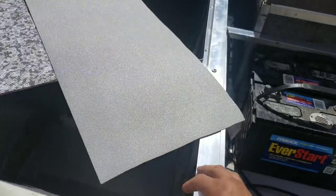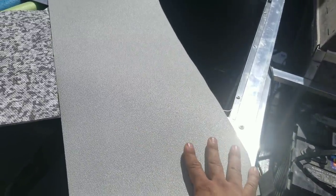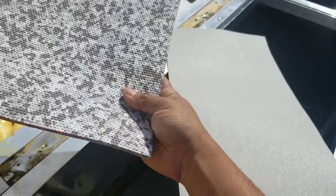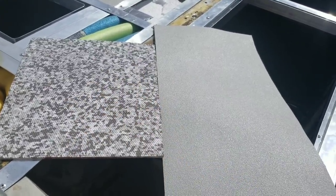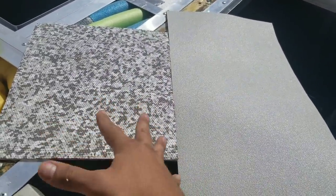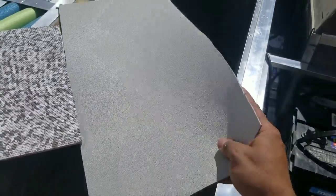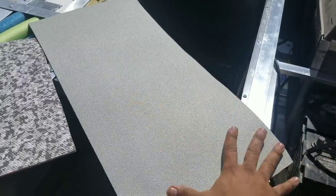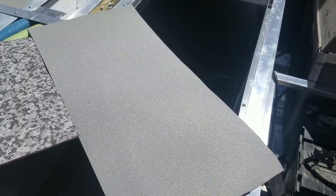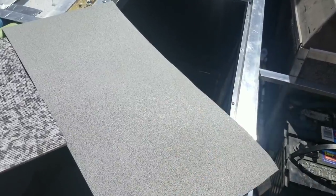This, on the other hand, is high-performance stuff. This stuff will not fade. The non-skid texture will not start to wear out in a month — who knows when it will start to wear out. I use it on most of my boats and there's really no cosmetic change to this. This is neoprene rubber. C-Deck is foam, guys. Honestly, how long do you think it's actually going to take before foam starts to degrade in the sun? If you put C-Deck on your boat sitting outside, don't expect even really a season of marginal use before it degrades significantly. But Gator Skin is legit recycled neoprene rubber with UV inhibitors directly in the material itself — it's extremely robust. It's the best stuff on the market. It's tested and tried in saltwater conditions, put on commercial fishing boats sitting in the harbor with no cover, constantly exposed to all weather conditions, and it doesn't see any wearing, tearing, discoloration, or cracking until like six years later.